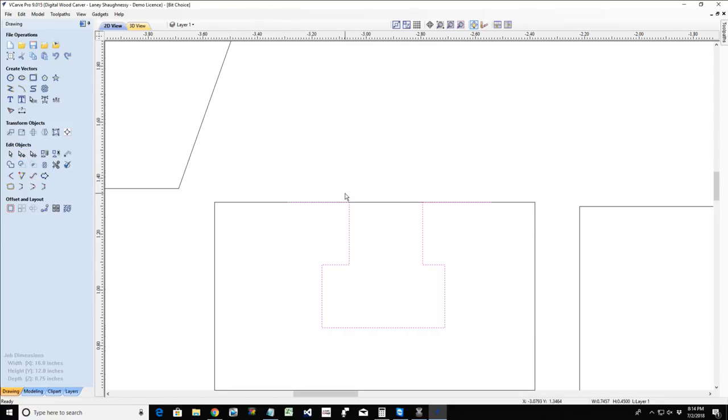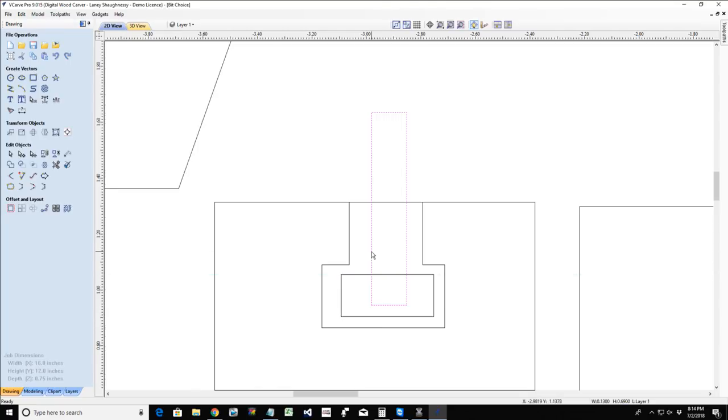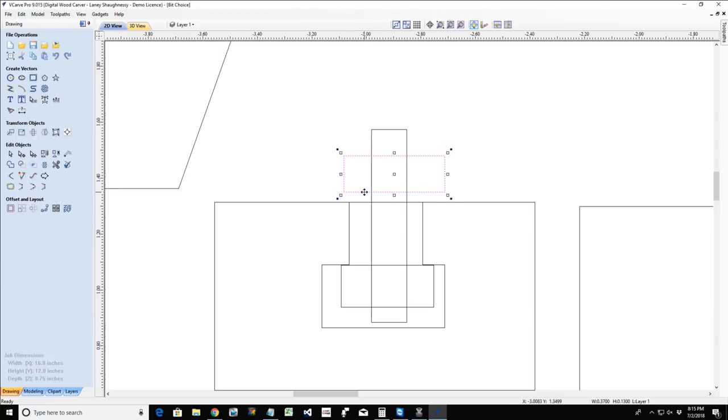So a T-track bit or cut using a keyhole bit or whatever means that I've got a bolt of some sort and a nut that slides into that T-track, and it kind of traps it so that when I tighten up that nut, it can't go that far. Therefore, anything that I'm securing is going to get clamped down to the top surface of my board.